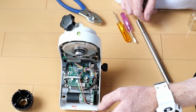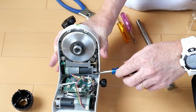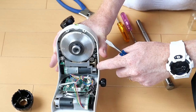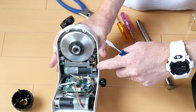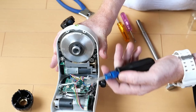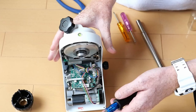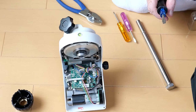There's another source of backlash that's much better to look at on the declination axis. We have two wheels: one connected directly to the motor, and one connected to the worm. The meshing of these two might add backlash, and the mechanism is held by three Phillips screws. If they're not tightened well enough, the mechanism can slip over time and cause backlash after extended use.